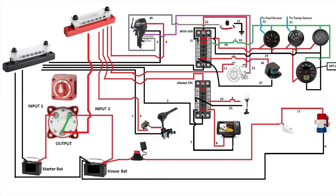Now that your outboard is started, you can switch your switch box to input two and it's going to use the house battery, so you can use your trolling engine and everything on the boat — it's all going to run on the house battery. Keep in mind your outboard right now is only charging your house battery since you're on input two.